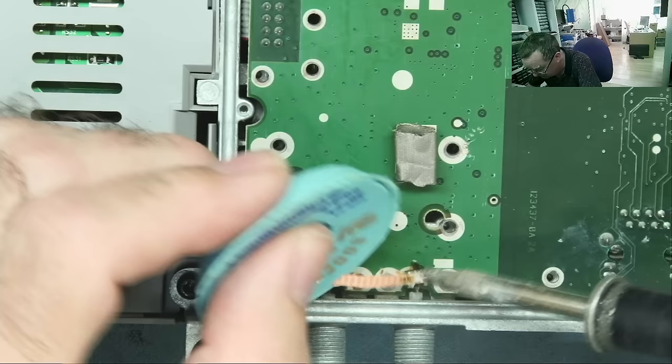And we see some codes here, L8, L8. Now that one says SOD323, that's the package. This one is SOT23. These are again something else. So it looks like, now you can even hover over them. Yeah. So it looks like it might be that one.